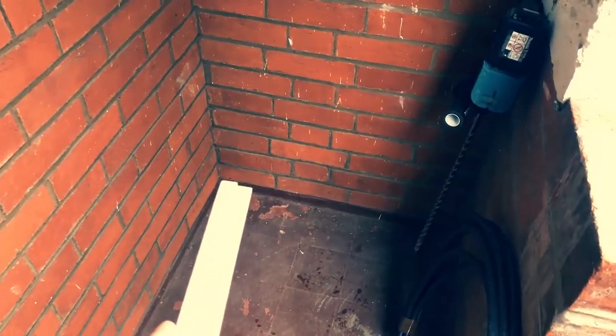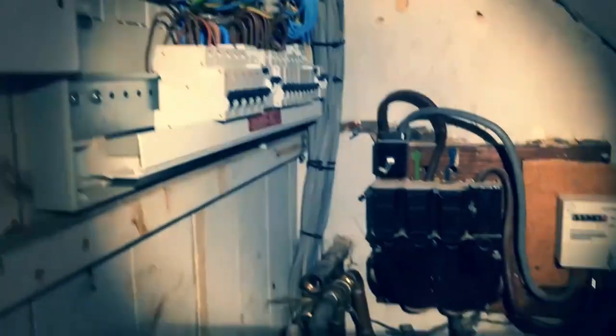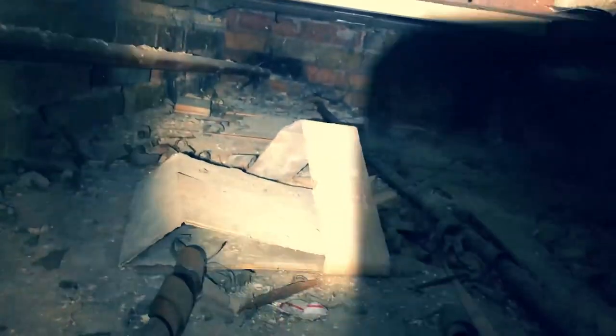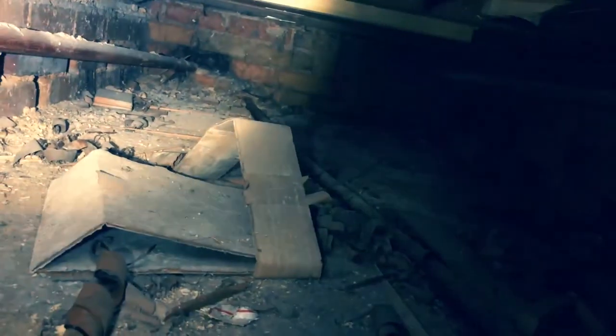I'm going to place the electric vehicle charging point here and then run the cable along the wall, drilling through under this floor into the under-stairs cupboard, under the floorboards, and then up into the consumer unit. I've got a spare way to fit a new circuit breaker. It's a bit tight under here and the underfloor is a bit of a mess. With my super rod mega set and a good drill bit, I should manage it. It's an old Victorian house — amazing what you find under the floorboards.